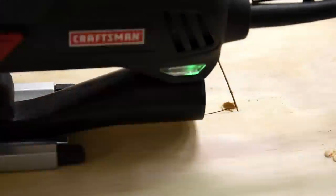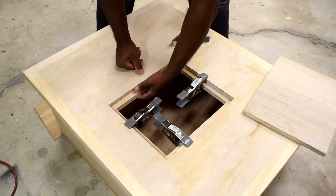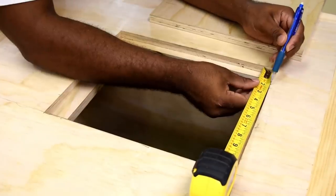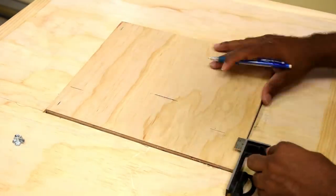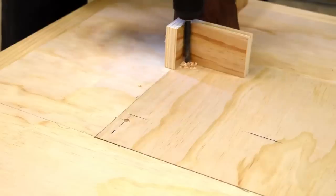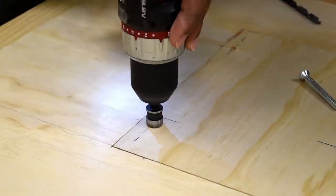The main focus is for the tool to be squared up with the front edge of the workbench, not just with the insert. These strips of wood will support the insert from the inside — clamp them along the perimeter of the opening and then screw them from underneath. If all goes well, your insert should fit in just fine. Now I'm going to add two holes on the front and two in the back to hold the insert in place. It turns out I didn't make the insert big enough for the circular saw — the width was fine but I had to open up the hole a little more front-to-back and remake the inserts. I used a framing square to help line up the holes, and used two pieces of scrap wood screwed together to keep the bit straight while drilling. I used a countersink bit — or you can use a larger drill bit — to make sure the screw is flush with the top of the wood.